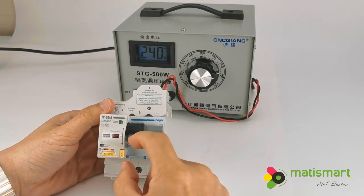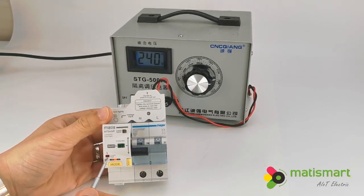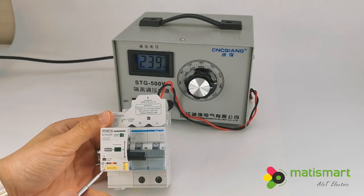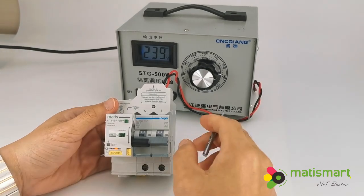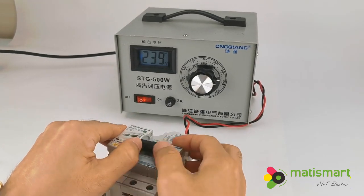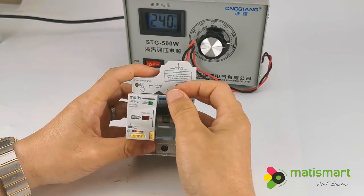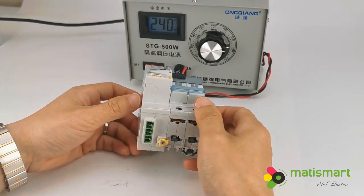When we continue to press for another 4 seconds, it changes to red. Red mode means auto reclose is enabled even after a circuit fault. For the current circuit fault in red mode, it will auto reclose in less than 10 seconds. Pressing again sets it to wait 60 seconds before auto reclosing — this is the three-times auto reclose sequence. The maintenance lock: when the lock is switched on, it is unable to switch on. Only when the lock is released will it be able to switch on again. Thank you.